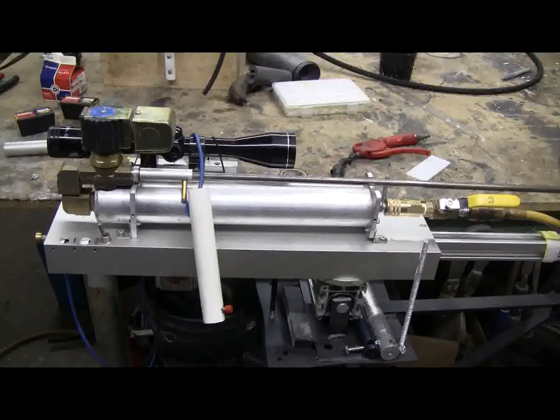Today I modified the 25 caliber steel BB cannon. What I did was get rid of the original setup for the 120 volt solenoid valve that was simply a push button that opened the valve off AC. This made the cannon work, but far too much air was being wasted per shot.